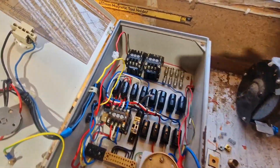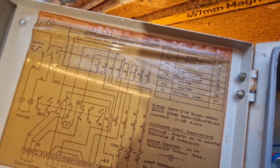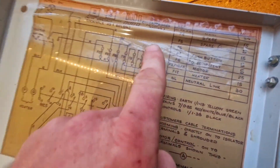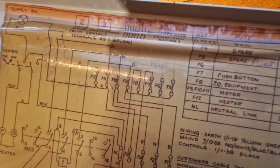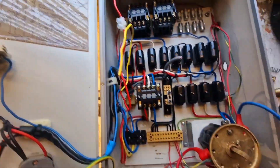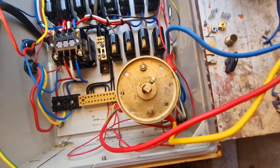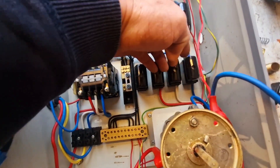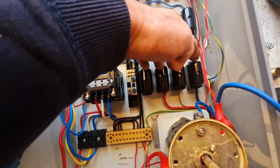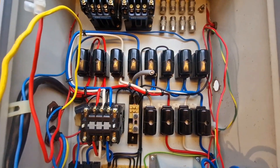We have got the original wiring diagram on this one, although there are some handwritten alterations at the top, so it looks like some changes were made when it was in service. We'll follow some of this through. We've got the main isolator there - that's the main incoming three-phase supply fuses, which would then distribute out between the rest of the fuses doing the various functions.